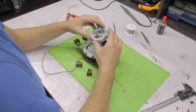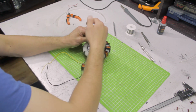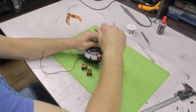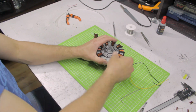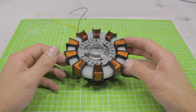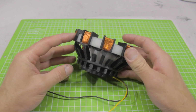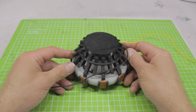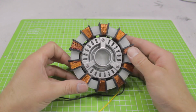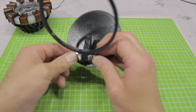We connect the colored rings together and fasten to the central part. Done! The reactor is assembled. Now you can try to remove excess glue on the coils with alcohol, or be careful when assembling. It remains to assemble the stand. It consists of two parts connected with an M8 bolt and a nut.